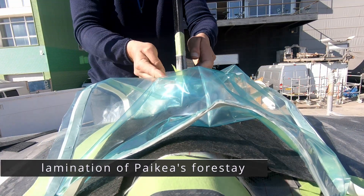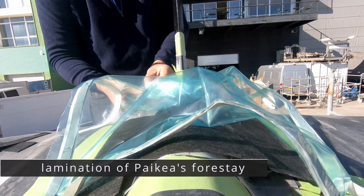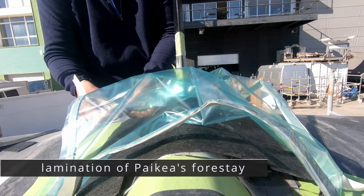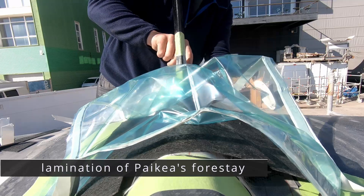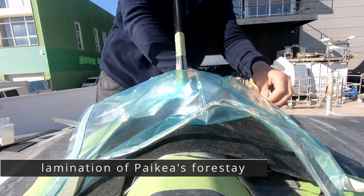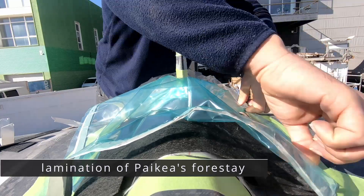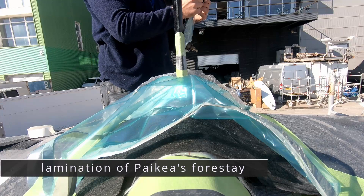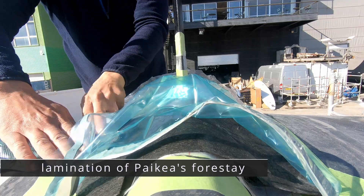Or you could press them instead of vacuum bagging them - that is actually a lot less consumable intensive. I may actually be able to do that. I've got a small flat panel I need to make and I might have enough stuff around to actually press the panel instead of vacuum it. Now pressing a panel, particularly with polyester, is very, very beneficial because you don't end up with all the volatile boil-outs. You can squeeze the living ba-jingas out of it and you don't end up with all this micro-bubbling problem.